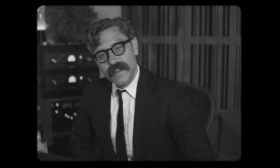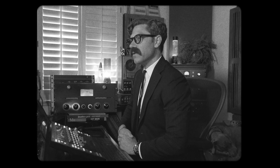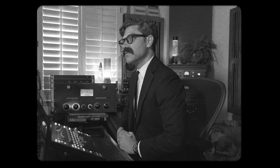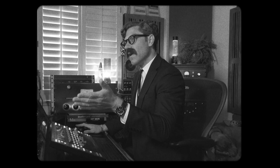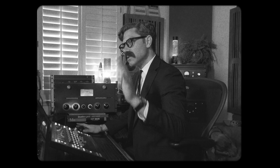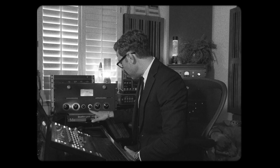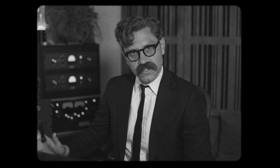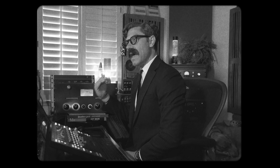So how does it sound? Well, let's take a listen. Now that we're here in the old laboratory, we're about ready to take a peek at the ASA 6A. I want to play a track by Tammy McCann from Chicago — a great jazz track tracked by my mentor Dennis Tussana at Chicago Recording Company. I'll play the song with no insert on the vocal first. We're going to send it through in stock mode: all the way hard and fast for attack, centered for release, and at 24 for threshold. I'm going to leave the high-pass off, put it in single mode, and level-match it. I'll take it out first, then we can listen with it in.